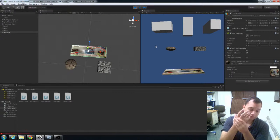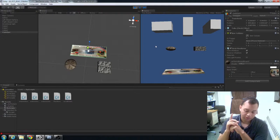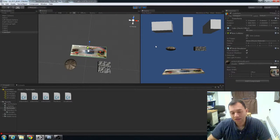You have a device that measures the orientation of your palm mounted to the back of your hand, since those are parallel planes. You'll have something that measures the articulation of your index finger, probably the 3 other fingers together, and your thumb. Then you'll have 2 haptic feedback vibration motors, and this big stack of Arduino shields and whatnot, all done over Bluetooth so that we're not restricted by more wires. So that's where I'm going, and I just want to share the lessons learned, the time put in trying to get this accelerometer to work the way I want it to, but by its nature it's just not going to do what I want.